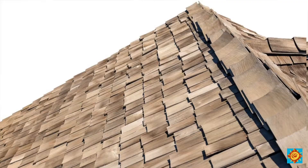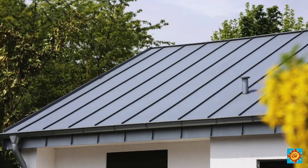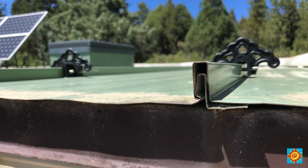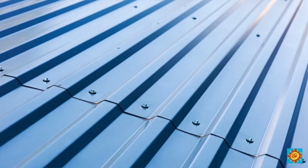It all starts up on the roof, and your roof design is super important if you're wanting to catch water and snow. You don't want to collect water with materials that are toxic, such as shingles or wooden shakes that have fire retardant in them. Most people choose a metal roof. There are a couple of different kinds — one popular option is pro panel, and the other, which I chose, is called standing seam metal roof. I chose standing seam because all the seams are covered, so there are no exposed fastener holes where water and snow can leak in.